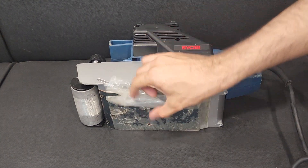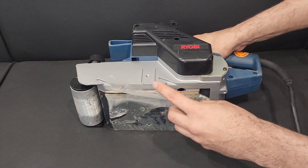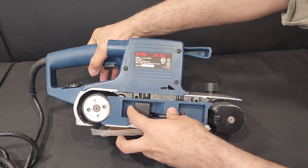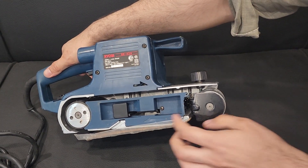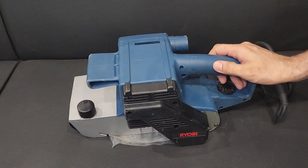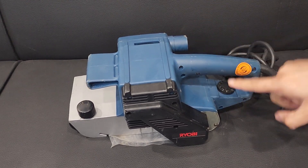The pieces you can see are brand new, box brown. I have removed the plastic shields so you can look inside. You can see the plate at the bottom. The belt adjustment here adjusts the size. When you pull the left side, the front wheel adjusts the balance, so the belt tracks left or right. There is also a dust collector port on this side. The switch has a lock so you can use it continuously.